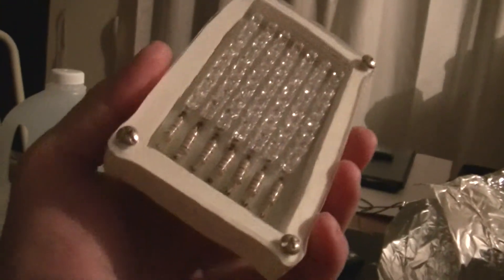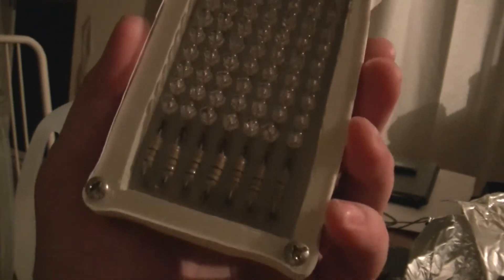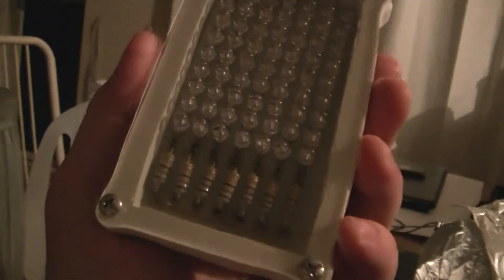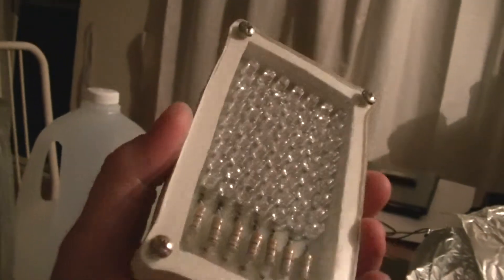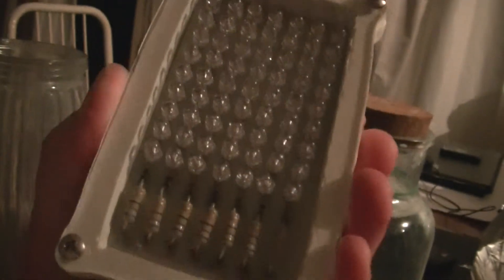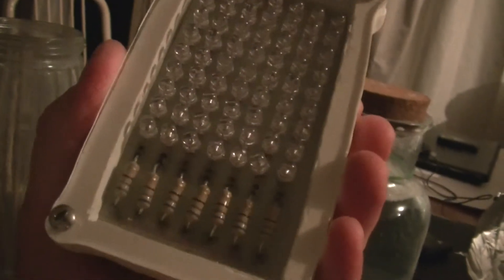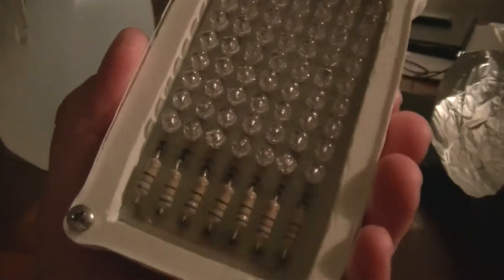Anyway, this is my latest LED illuminator design. One of my designs I made before, but I didn't box it up until today, and I've changed the LEDs so I can run them off two 9-volt batteries, making 18 volts. These are less powerful LEDs than my other 70-LED illuminators — these are the first ones I bought on eBay, which are 940 nanometers, but they're not high-power wide-angle like the 500 ones I got.